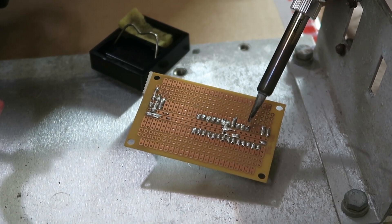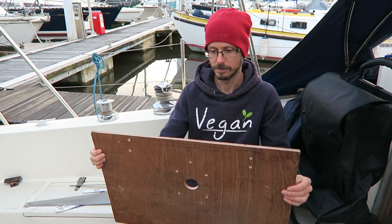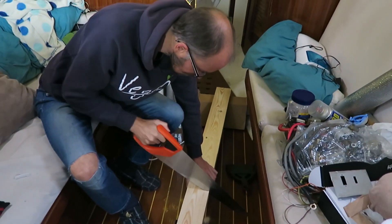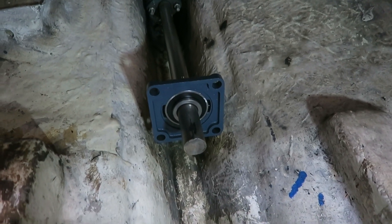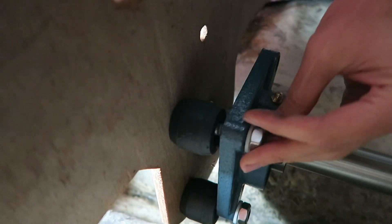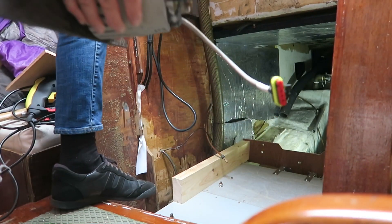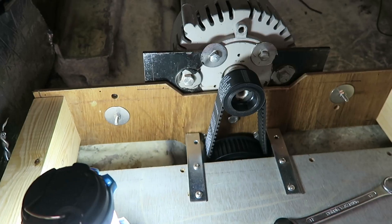Then we just had to figure out how to mount the motor. Here I'm making a plate to mount the motor and the bearing, just out of some spare plywood we had on board. Ideally we would have used metal, but we decided to use what we had on hand for now and replace it later if necessary. Jonathan built a platform for our batteries to sit on, which attached to the motor mount. Then it was time to put it all together, starting with the bearing. The battery platform went in and the mount was attached to the bearing. The first pulley was fixed onto the prop shaft with a belt, and another pulley was attached to the motor with a belt connecting them to give a 2-to-1 gear reduction, which is recommended for most sailboats.